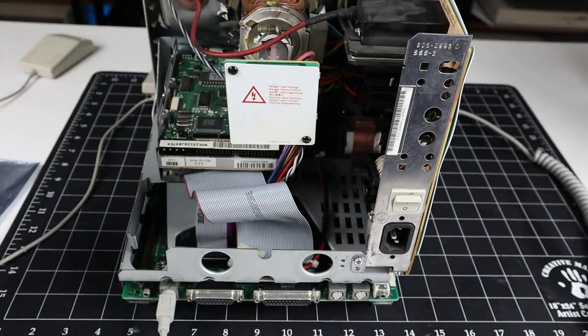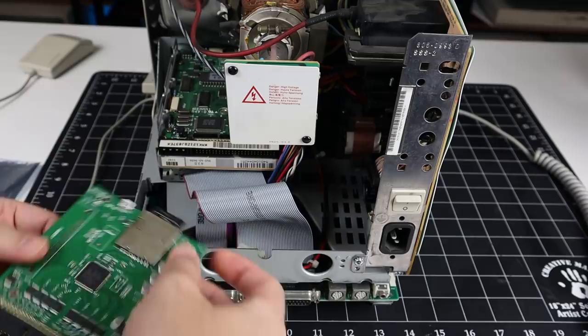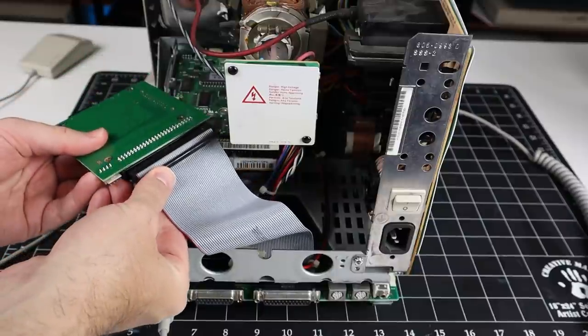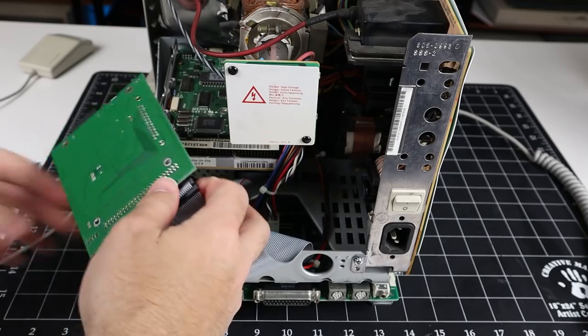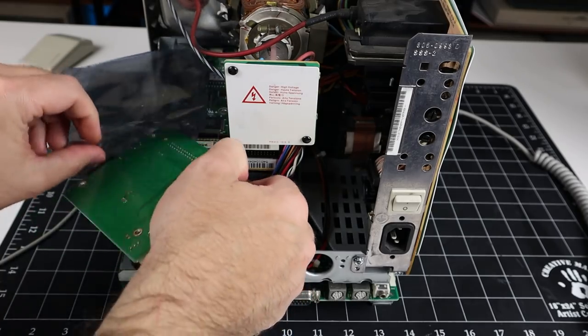Here's that SCSI to SD I mentioned. It's an older 5.1 model, but I've never used it for anything else, and it'll get the job done for now. I could 3D print a mounting bracket for it, but this is only going to be here long enough to verify system operation. Long term, I'll need to look into the Blue SCSI project for this Mac.